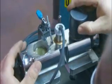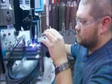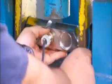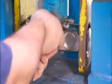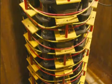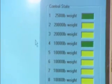The smallest amount of moisture or dirt would cause a strain gauge to malfunction, so they weld a cup over each one to hermetically seal it within the load cell. Every finished load cell undergoes a quality control check to verify that it works properly. The testing machine applies weight in increments until it hits the maximum weight the cell can bear, 34,000 kilograms or 75,000 pounds.